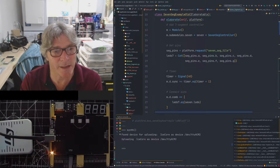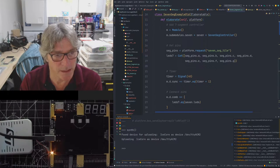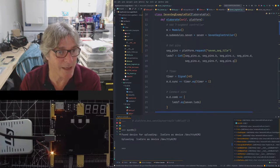So what happens there is you've got this auto-magical detection of the FPGA image. So if you send an image to the serial port that is connected to the BlackIce NXT, just like the BlackIce MX, it recognizes that that's an image coming to it, and it programs the ICE40 with that FPGA image. It looks for a particular signature. So that is the same from a backward compatibility point of view. We provided that same background. So that comes up as a USB CDC serial port. That's the way that the USB comes in.